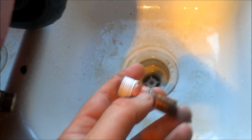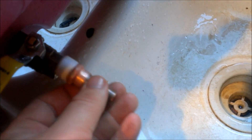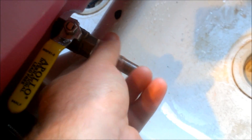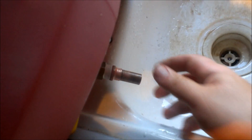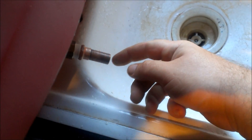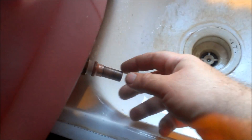After using the carb cleaner I washed it thoroughly with soap and water and dried it, then applied the Teflon tape. I'm going to screw this into the end of my ball valve. This piece of half-inch copper we soldered on is what I'm going to attach that 5/8-inch inside diameter, 7/8-inch outer diameter plastic tube to — that's what will drain the wort into my boil pot.